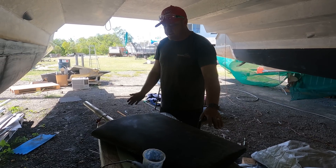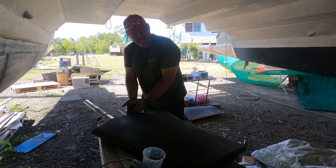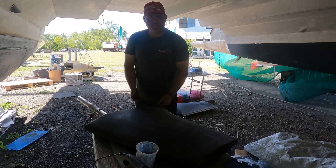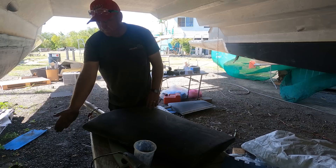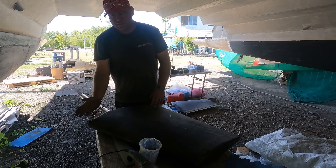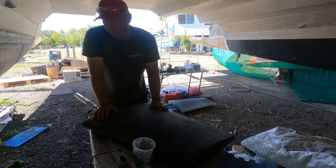If we reduce that by making this edge closer to the hull so the water can't go around it, then it'll force it to go off our nice thin perfect edge at the back. We're going to build a piece out the front here so it goes up a lot closer to the hull to reduce our end plate effect - and those two things there are the best bang for the buck that we can do.